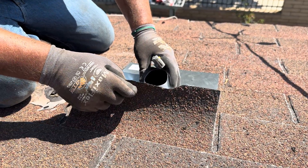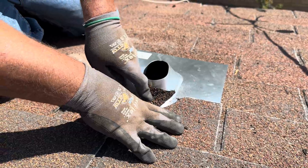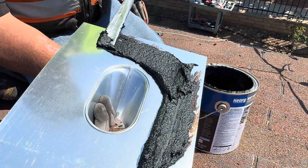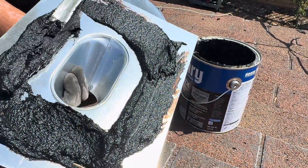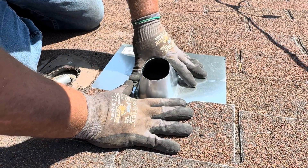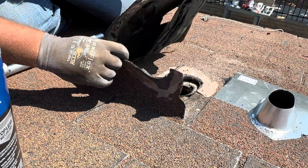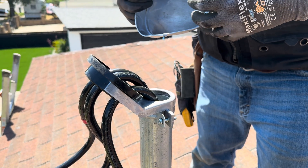When setting the new flashing, lift up an old shingle, slide it underneath, and line it up with the hole you drilled, then cut right around where it's going to go. Use a piece of three-quarter-inch conduit that's been flattened out, and make sure you get the mastic underneath all the way around for a nice watertight seal before sliding it up under the shingle. For plugging the old hole, do the same thing — get a bunch of mastic under the shingle and into all the cracks.